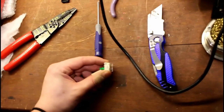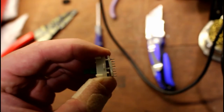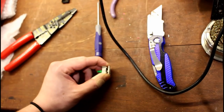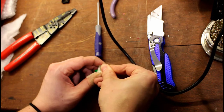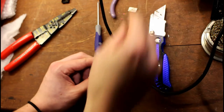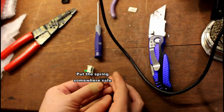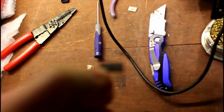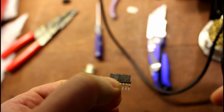You're going to want to proceed carefully. See the spring right here? You don't want that spring to spring, because then you're going to have a bad day. Just slide this bottom piece off and cover the spring so it doesn't go flying. Now that we've got that off, we can get at this circuit board down here. This is the bane of the SH-101's modern existence. It's just disgusting — black and cruddy as anything.